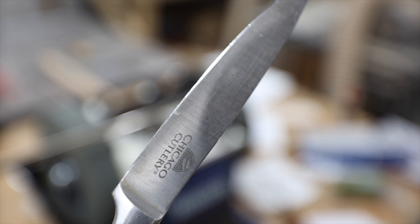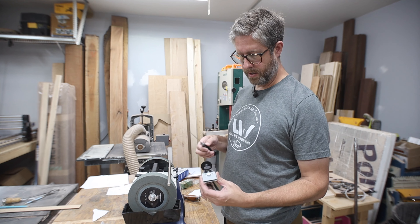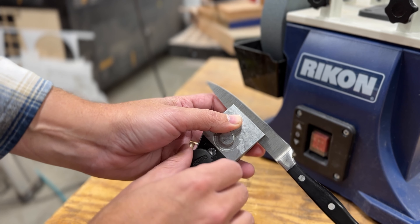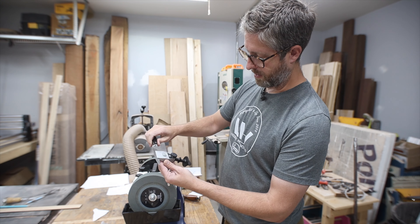Now that I'm familiar with the grinder, let's move on to some knives. You can see just how bad that edge is — really jagged and dull. This is the Tormek KJ45 Centering Knife Jig. I got this one because the quality just looked a little bit better than off-brand ones. You put your knife in here basically centered, with the face parallel to your edge. Tighten down the silver one until it's tight — that one pinches, and then the other one acts as a counter-lever so as you screw it in, it spreads apart here and clamps. That acts as an even better clamp.